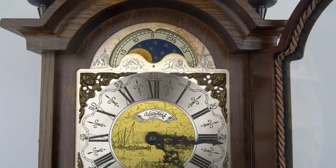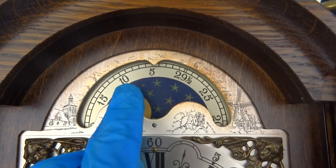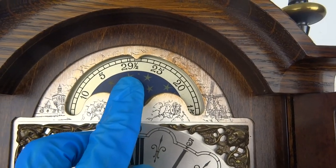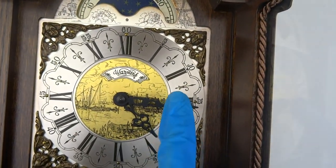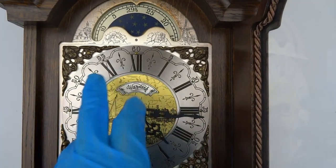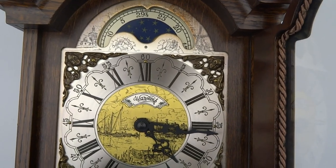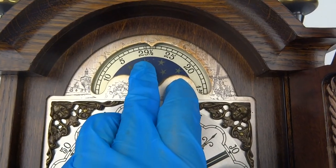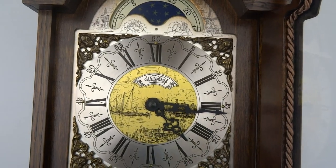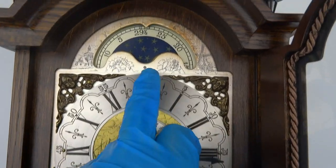It's also very important to know that when your moondial jams — right now I can move it no problem — but sometimes it jams. In that case, you have to rotate the larger pointer a couple of hours, maybe 12 hours total, forward, and then it will release the moondial. If you do that, always let the clock chime on the half and on the full hour.